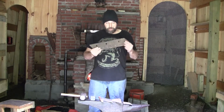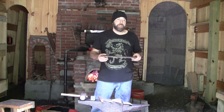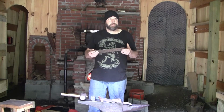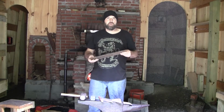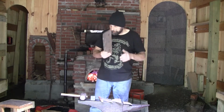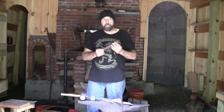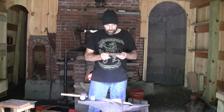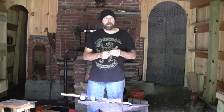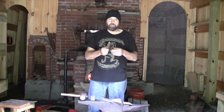So these are pretty old, and I would venture to guess that some of these are probably about 50 years old. So anyhow, if I'm making something like a knife or sword or an axe edge, I'm going to want to use something like this as part of it when I'm doing pattern weld. And the other thing that I'm working in my pattern weld is wrought iron. Unfortunately, I'm all out of square stock, but I will show you a close-up of the end of this in a minute or so, because it'll demonstrate one of the things that is special about iron.